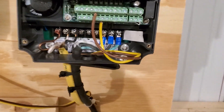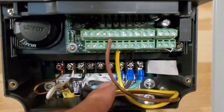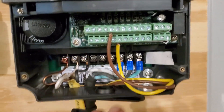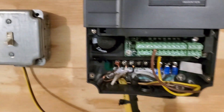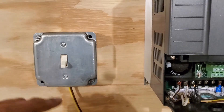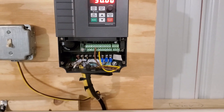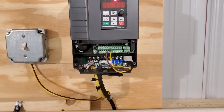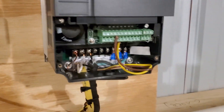When I was talking about the continuity circuit earlier — S1 and common — that would be these two wires here, the brown and the yellow. The brown and the yellow on this setup is just a light switch, that's all we did. Something simple. You could do a thermostat if you would like, so it would automatically turn on and off when the temperature hits the correct timing. But in this case, we just did a light switch — just trying to keep it simple.